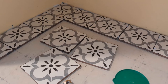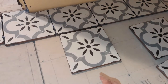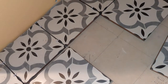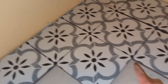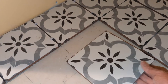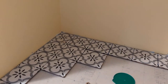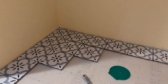The last thing to pay attention to is the pattern on the tile. When I originally laid some of these in on the first row, I had some of them turned, and I realized that the tile pattern works best when they are all laid the same way — not when they're flipped. So as you lay the tile, make sure you're aware of the pattern and maintain it consistently, so it doesn't bother the detail-oriented person who walks in and sees one tile out of place.